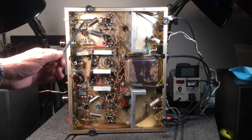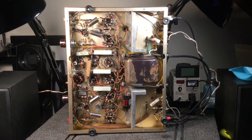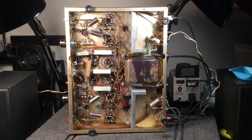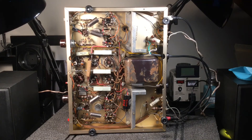One thing I wanted to point out — I did re-tap these holes and placed new feet, brand new feet, which will lift the amplifier off the surface of whatever it's placed on and allow air to circulate under the chassis. I do want to mention again — it's really not safe to not have a bottom plate. I don't have a solution for this particular client; I'll let him know it's dangerous. I do have a resistor that will drain the voltage once it's turned off, but there's really no excuse for having no bottom plate from a safety standpoint.